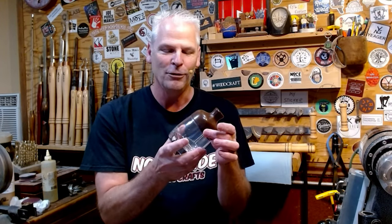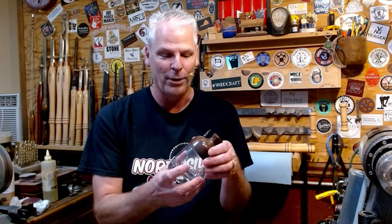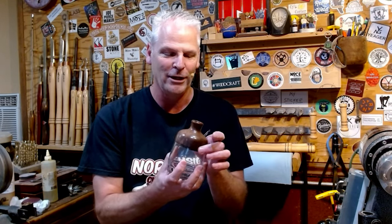As I mentioned at the beginning with the glasses we did a couple weeks ago - make sure you leave a little bit of room in there. This is a thicker glass than the one that broke. If you make it too tight, it would pop the side off. If there's any wood movement, the glass is weaker than the wood, so it would pop. Just make sure you leave yourself a little bit of room so they don't end up breaking after you fill them up with water.